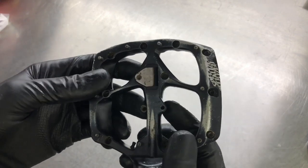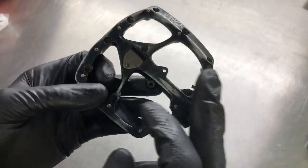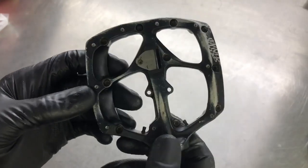It kind of works but it's not ideal. What I'm going to do is soak the pedals, put new bearings in, clean the axle, put replacement pins in — or capped socket screws to keep the concave going — and I'll talk you through it.